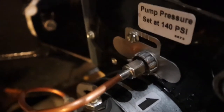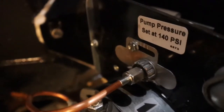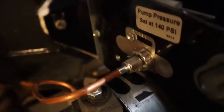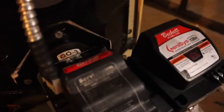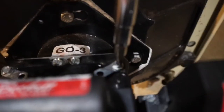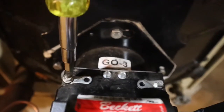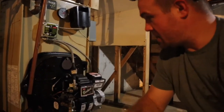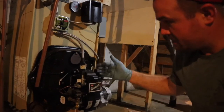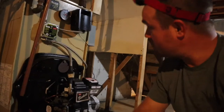You want to be careful on these ferrules and anything that's flared or double-flared — if you over-tighten them you can actually split the flare and then you're in a bad spot. So, that's back on — that's the fuel line. My burner assembly's back in. Closing this up, flipping these screws around to hold it in place, tightening them down. Basically everything's buttoned back up. I have my new nozzle — the whole shebang — and arguably we're ready to fire this thing up.